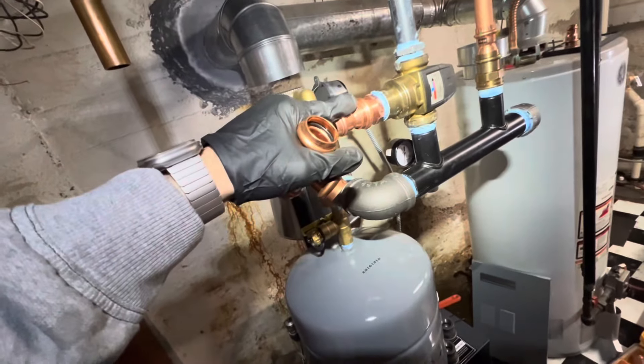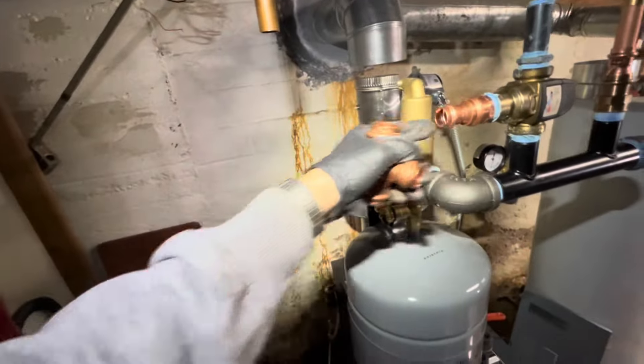So here's where we're at. We got our expansion tank, our pressure reducing valve with gauge, along with our isolator for the expansion tank, which just cleared the tridicator gauge. Right now we're working on putting our circulators in here on our supply side — this will be for our radiant with the mixing valve, and this will be for our main zone. So, so far so good. Our circulators are on. We are working on now bringing up our return to pick up this line as well as mix with the cold coming into the mixing valve, so we got to tie it in with a T there and a T here.